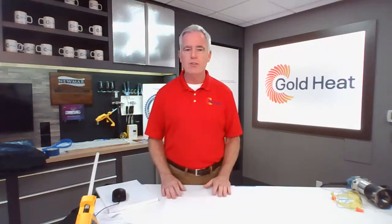picky that you need to glue down, like a marmoleum, or for that matter, cork floor, or a luxury vinyl plank that's not a floating floor that needs to be glued down, or there are some that actually are loose laid. So that's a great application for our gold heat product in a self-leveling compound where you have a really picky floor. And I think that really kind of gets the end of all the different floor categories.